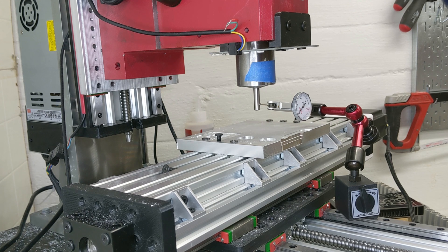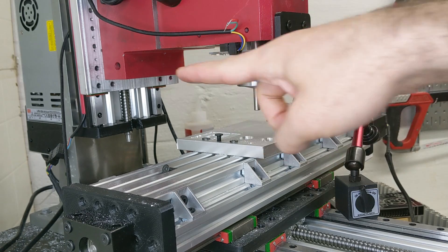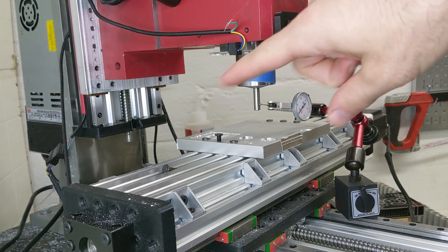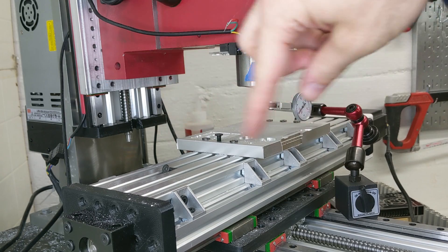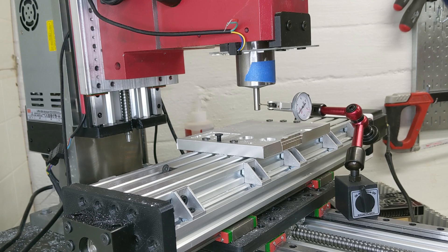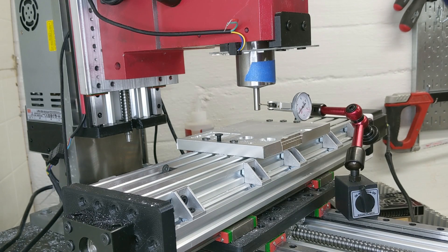When the mill is cutting and it is in a cut, I would expect this travel direction to be much more rigid. You can see a certain direction of your mill is going to chatter more than the other. I would expect traveling one way to be more chatter prone. With 3D adaptive cuts the forces are constantly spinning around, somewhere between one spring constant and the other. You generally go for the weakest link, and right now the X direction is the weakest link.